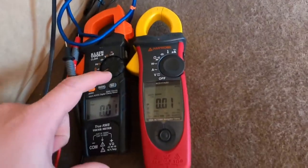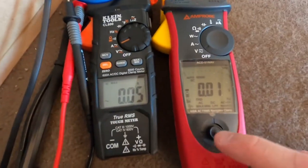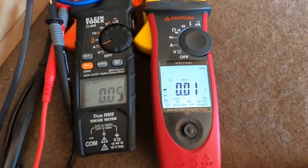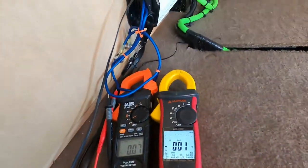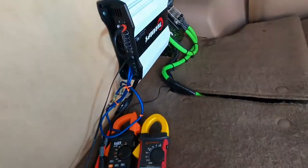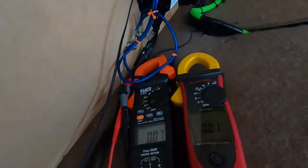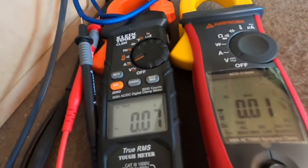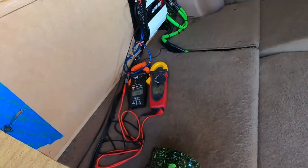We're going to set both of these on max hold — that's our max amperage and that's our max voltage — giving us our max peak AC output number. Now I'm going to run a 30 Hertz tone, pretty well wide open. I'm not going to clip it to death trying to get maximum power, but we're hoping for a pretty good number. This will tell us our actual power, our impedance rise, and give us some real data.